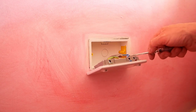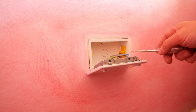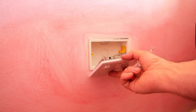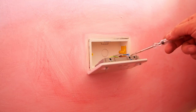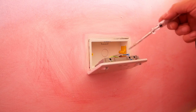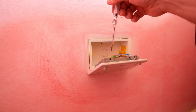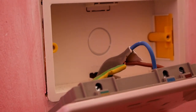Make sure your cables are in there and not loose in any way — give them a wee tug to make sure they don't come out. If they come out, it's too loose. If you don't make them tight, you can get sparking where they're not tight enough, and that tiny spark can create heat and melt your sockets out. If you're really unlucky, it can cause a fire. So make sure your cables are in tight.